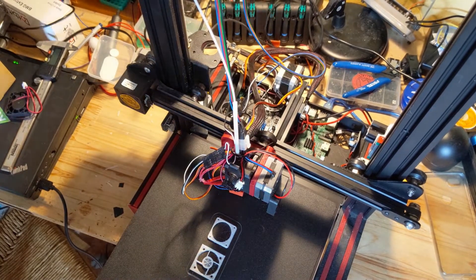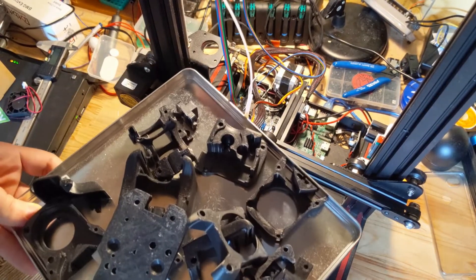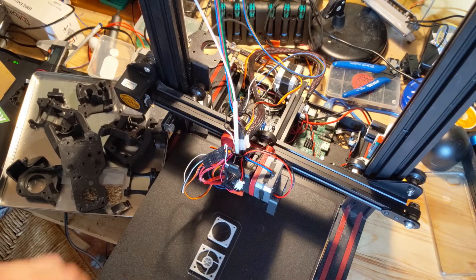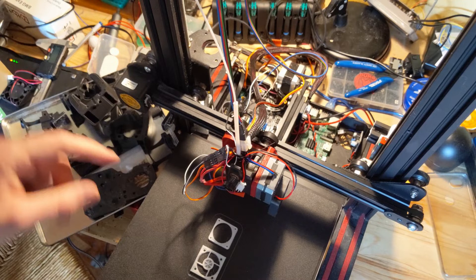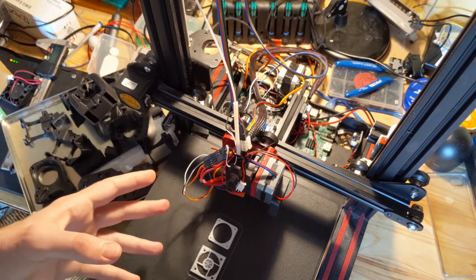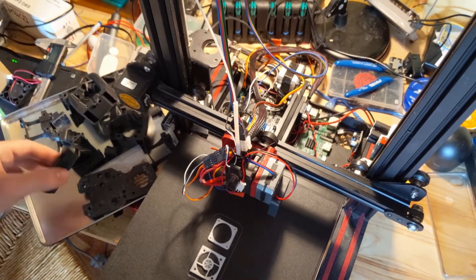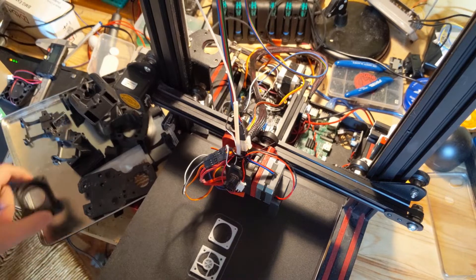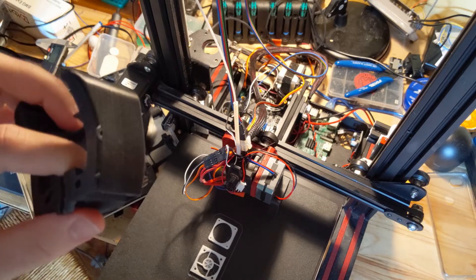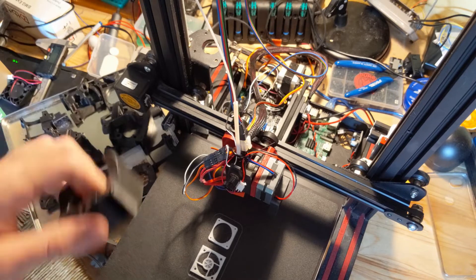I have already prepared a few parts and ordered all the necessary components, but first a small note on printing ABS on this thing. You're gonna want your hotend mount to keep up with your hotend temperature. If you set your thing to let's say 250 degrees printing some nylons or something and the thing starts turning into a puddle, that's no good. So at least your hotend mount you're gonna want to print from ABS or any other heat resistant material.